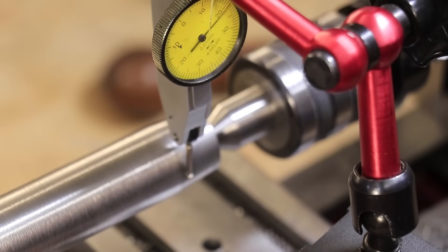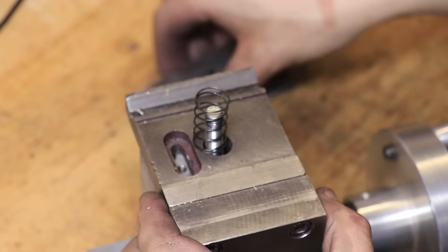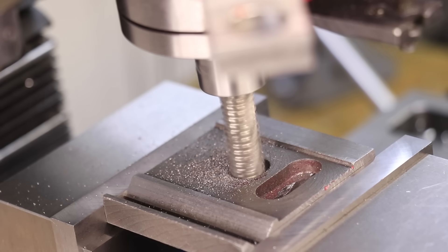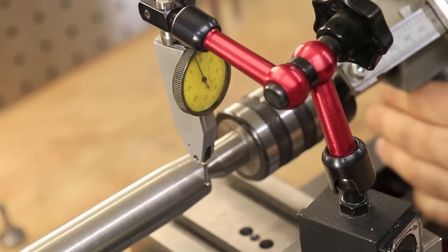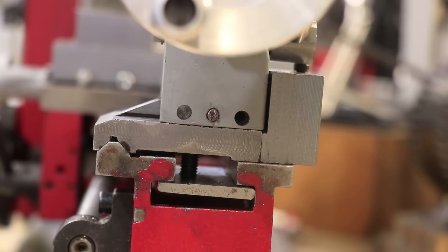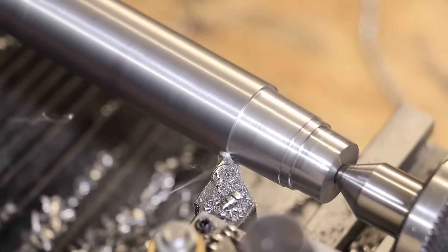Unfortunately, the largest angle I could get using this method was about two degrees. Initially I thought the issue was to do with the hole in the base of the tail stock not being big enough to allow the necessary movement, so I took it over to the lathe and turned that hole into a slot. But even with the slot cut, I was only getting about three degrees of taper. The real issue was just the small amount of space between the lathe bed — the clamping thread was actually hitting the side of it. So three degrees was really as much as I was going to get, but three degrees should work.